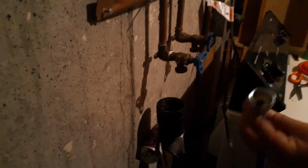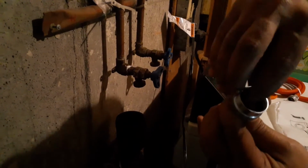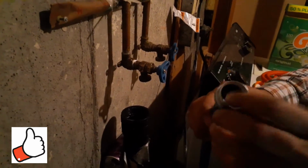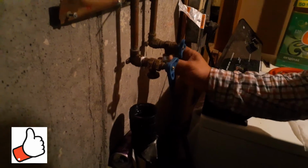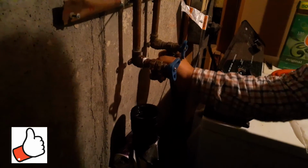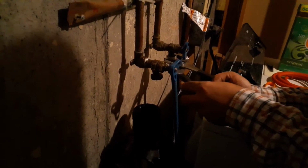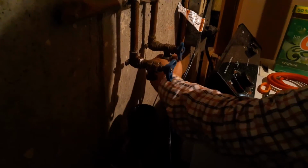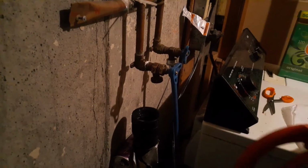Okay, this is the new hose. You have to make sure that this rubber gasket is here. It was in the back, so I had to put it in, so make sure not to lose it, and make sure that these rubber gaskets are there on both ends. So simply just hand tighten it. Don't go super tight, just snug. That's it. It shouldn't be opened easily, but if you apply force, it should be easily opened then. So same thing goes with the hot water line.